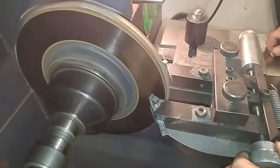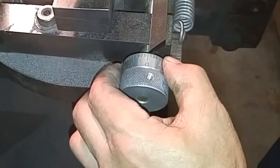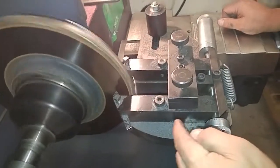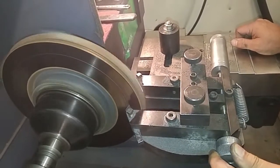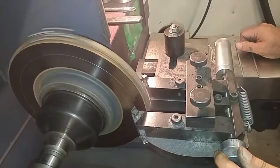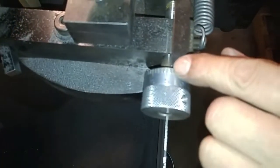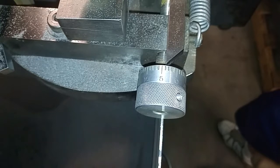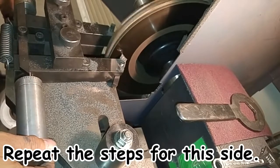This is the touch point, so we'll set this to zero. I'm watching the dial and determining how deep I have to go to make a total concentric cut. I've got four notches right here — we'll set this to zero. Let's go in just a little bit here, let's go to eleven.